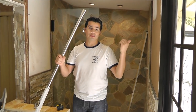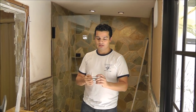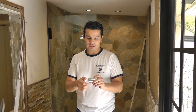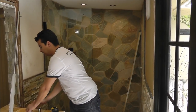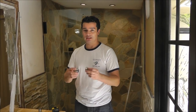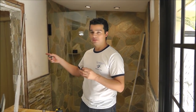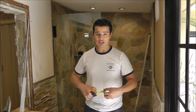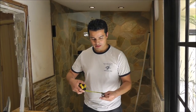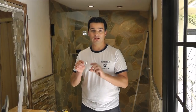To put it into the wall — this is not one piece, it's actually two pieces. When you turn it and untie the screw, it becomes open. So if you want to know how much to deduct from the 61 inches to cut the metal, you can measure. In this case it's 9/16 of an inch — that is the end part that's going to be screwed to the wall.